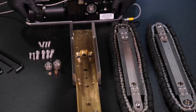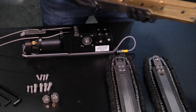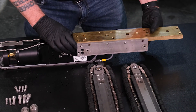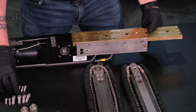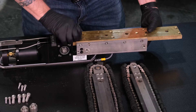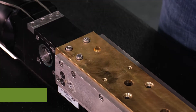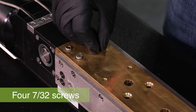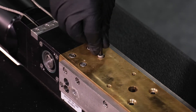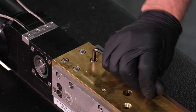Place the motor body upside down on a work surface and start by putting the base plate with the tread mounting plates attached in place on the motor body, so that the end of the base plate with the four inset screw holes is lined up with the matching holes on the motor body. The four base plate holes should be inset on the side facing you. Use four 7/32nd screws to attach the base plate to the motor body using an Allen wrench. The tops of the screws will be flush with the surface of the base plate when tightened.